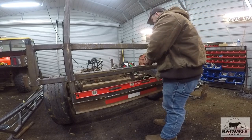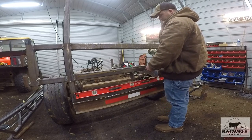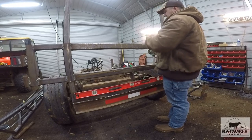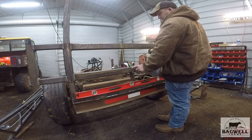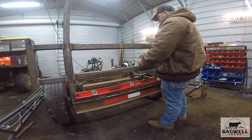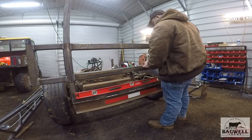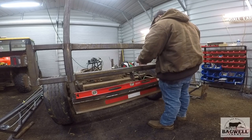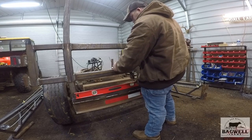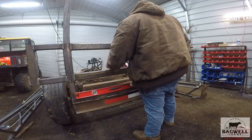The tubing is two and a half inches thick, so I've got to account for that. This is going to be from inside to inside. Once I run a piece long ways, I've got to take out the width of this tubing to get 10 inches. So my end product - I want it to be 10 inches right between here. I've got to take out the tubing width, which is two and a half inches. Right there's the mark - that is where I'm going to cut. I'll add an arrow so I don't forget, with the way my memory is these days.